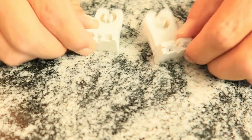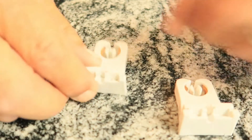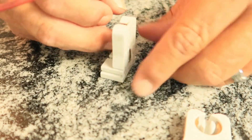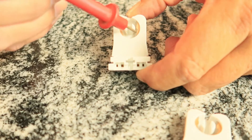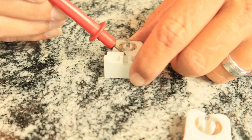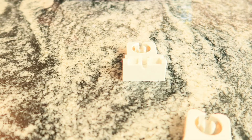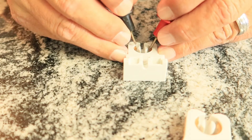These are your tombstones — and for whatever reason they call them tombstones; you can probably see why, they kind of do resemble tombstones. Inside of the tombstone are these little brass contacts. Around the white body you can see there are brass contacts inside. Non-shunted simply means that these brass contacts are not connected internally in the body of the tombstone — they are individual pieces. The way you want to test whether you have a shunted or non-shunted tombstone is get your ohmmeter and set it to a tone so you can audibly hear it, then just press it against the little contacts inside.